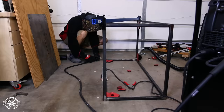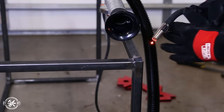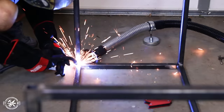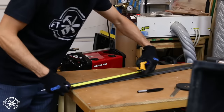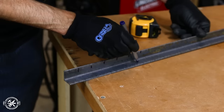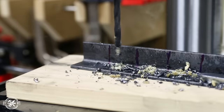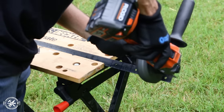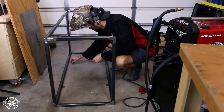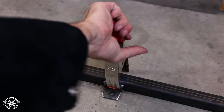I really enjoyed welding a full project by myself — this was only the second welding project I've ever done and the first time solo in my own shop. I got better as I went but I still have a ton to learn, so hit me up with your welding tips in the comments. To finish off the base I added some tabs from one-inch angle iron to screw down the top — drilled oversized holes, then cut the tabs apart with a cutoff wheel on my grinder. And welding 101: don't weld your clamps to the work. Jeez.